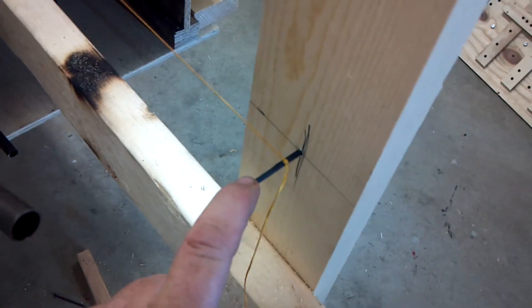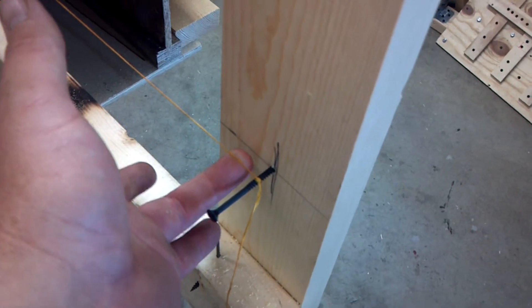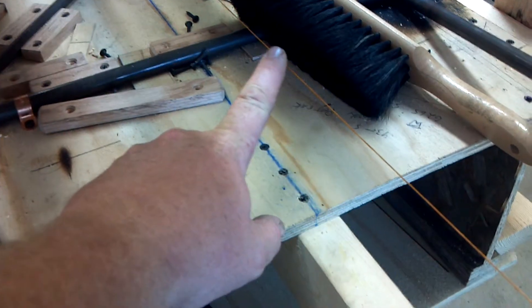I put a screw in here. You get it close, wind the string, grab it with your finger, lift it over the winding. And make sure that your string is square to that table line — that table line that we originally snapped is very important. That sets everything on the airplane.